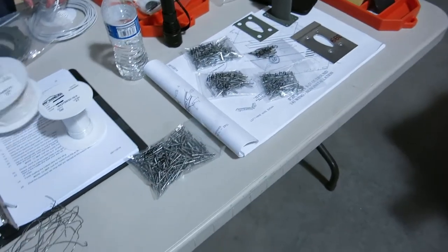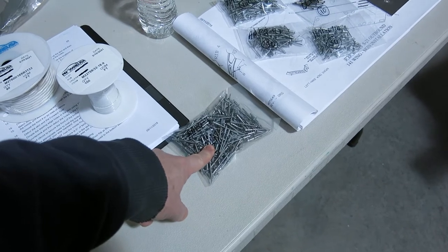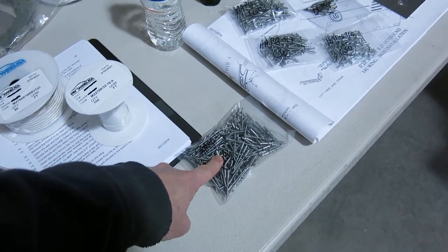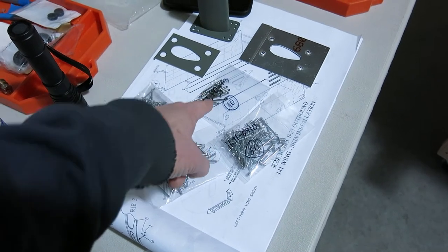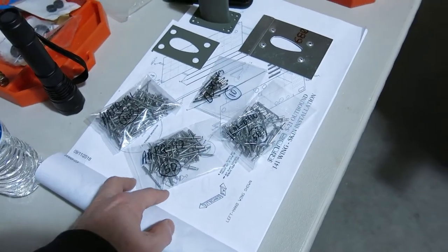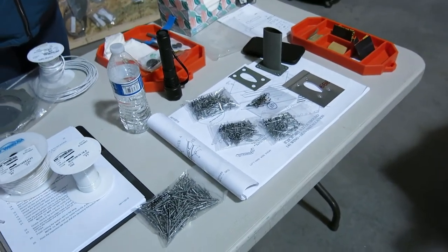Oh yeah. We had to get some replacement rivets for that rear spar, where they had specified too short of a rivet. So they owed us 210-43 rivets, and we got those in. While I was at it, I ordered a bundle of extras because we've had to replace some. The CCPQ stainless 43s, we've had to replace a couple of those. So I picked up 10 of those, 50 of these rivets, 50 more of those, and another 100 of the dash 41s. So we got those in, and we'll just dump those into the stock.